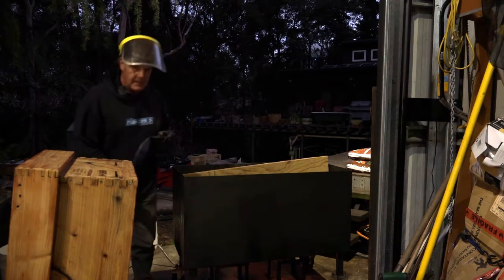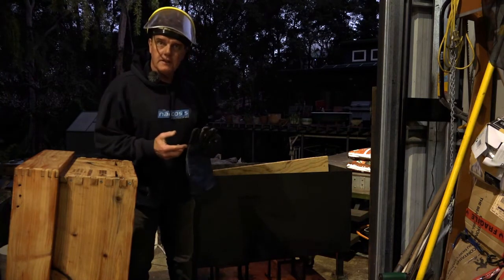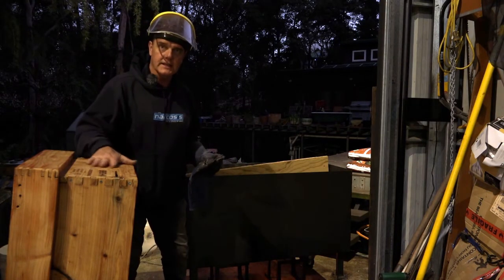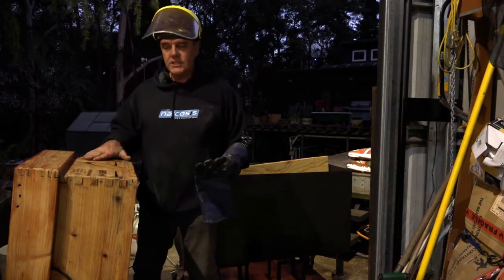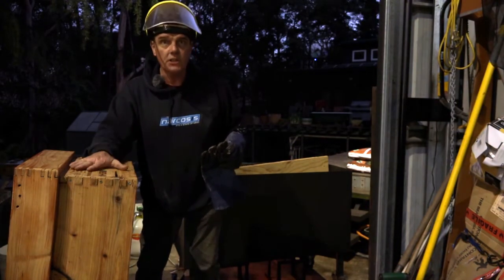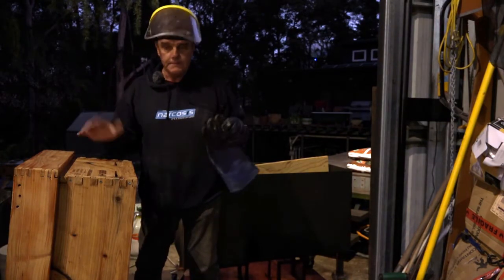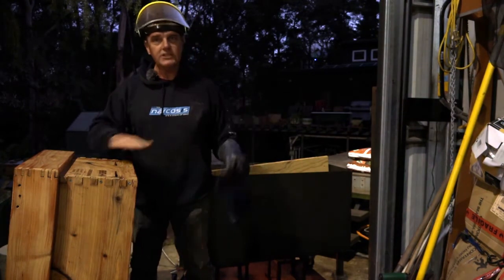Now, if you wanted to have a painted finish, but still have the benefit of hot wax dipping, this is the time to paint. Bit awkward doing it flipped around, but if you do it in one hit, like our main box here, while the wax is still just a fraction after the wax is sucked into the grain, so it's dry to touch, but still hot, you roll on really quickly, you paint, and the paint then draws into the wood as well. It'll suck in millimeters depth compared to normal paint that just sits on the surface.